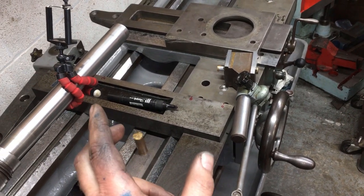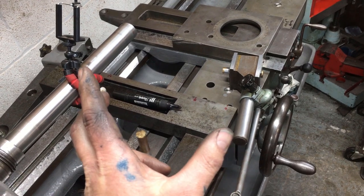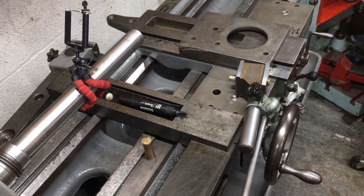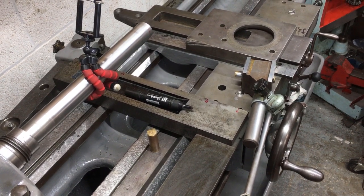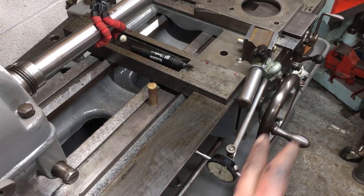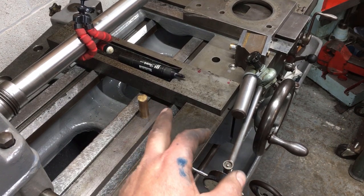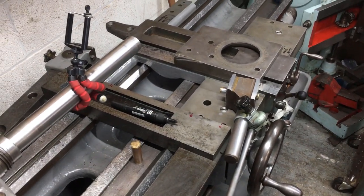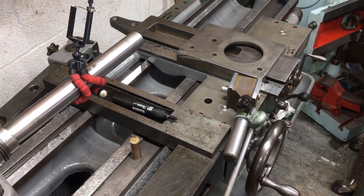We're looking for just under half a thou over 12 inches, which is what, 0.015 millimeters over 300 mil, I think it is. So I've got it parallel now that way. I'm musing on whether I want to clamp it down, because if I clamp it, it can't move when I'm moving the DTI around, and from memory things tend to become a bit mobile.